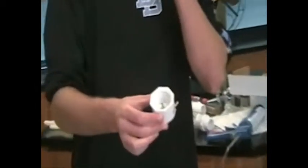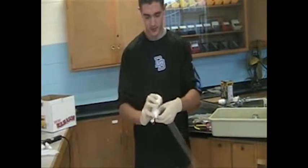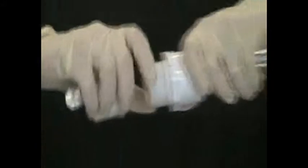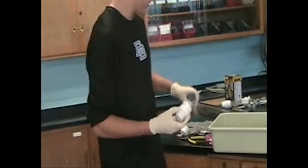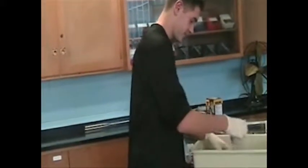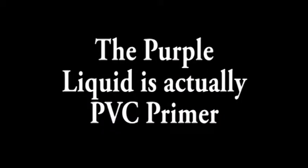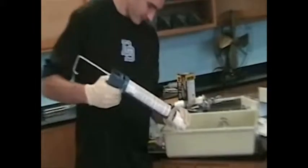Let me get a nice close up on that. Pulling all our parts together — when we're done, it will look like this. It will go there and screw on here. But first, because the marine adhesive doesn't stick to PVC, you have to use this primer stuff. And then we put the marine adhesive inside.